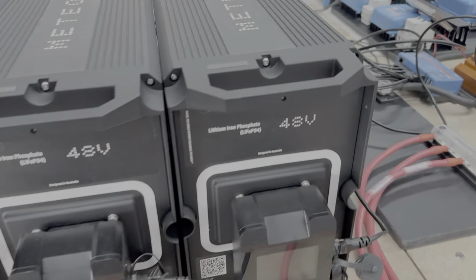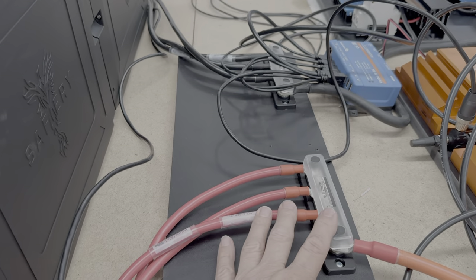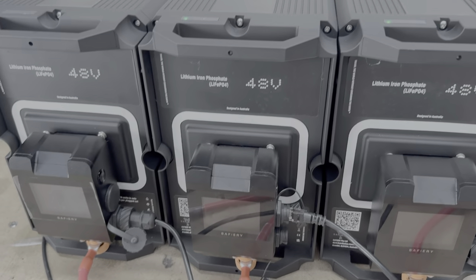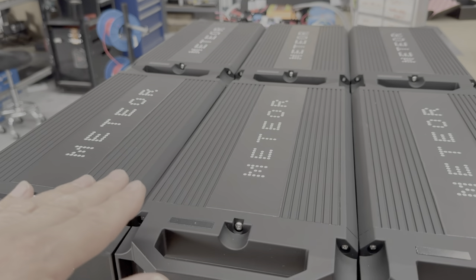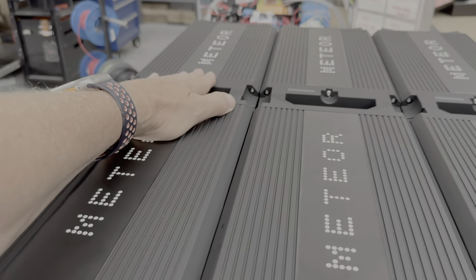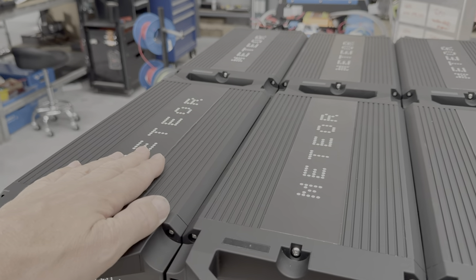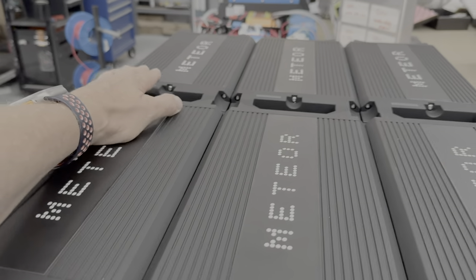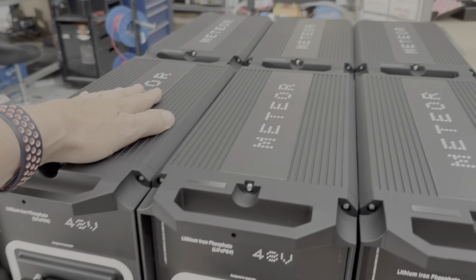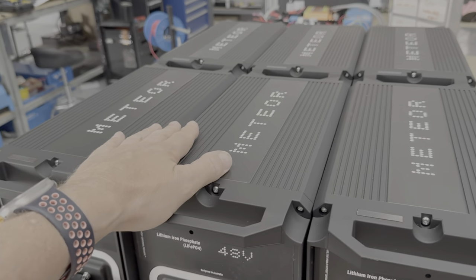At the back end of the battery train is the negative plug — a very simple little negative plug. What we've done on this Sail Ningaloo is we've just joined them all up on a bus that we're going to be sending over to Luke, so he can join each individual battery train up. These batteries are totally redundant. Even though they're plugged in together here in parallel, if you turn this battery off, the other battery will continue to run. Totally redundant.